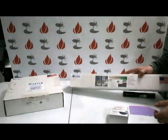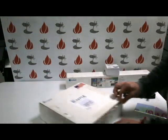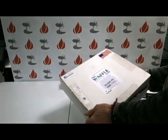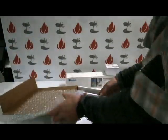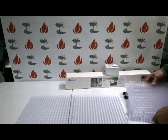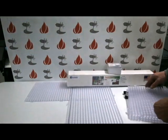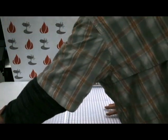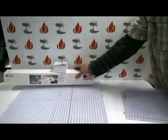This system not only gives you good clean cuts, but you also get repeatability and easy operation when changing setups between cuts. The first item is called the waffle grid. The waffle acts as a grid system to hold shards of glass that are created when cutting. These shards lie on a flat surface and will scratch your glass when cutting and can also cause breakage if they're underneath your glass during your cutting operation. With the waffle grid you'll avoid all of these issues.